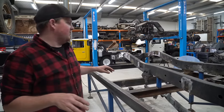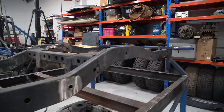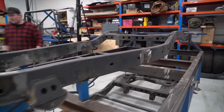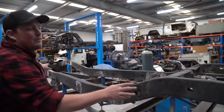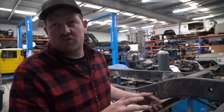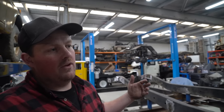The chassis is sitting on the table. From a previous 80 chassis we've done, we left a couple of different fixture points. We've dropped the chassis on and tacked it in place for the meantime — it's only tacked lightly. We're going to take a few more measurements to check there's no twists and everything's square. From there, we'll throw the outer plates on front and rear, tacked lightly, which will allow us to put the remainder of the chassis bracing to the table. Once that's done, we'll remove the remaining crossmembers and start putting the inner plates in to build a chassis.